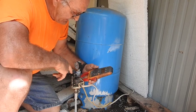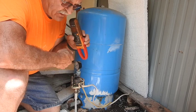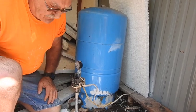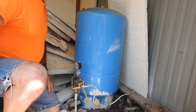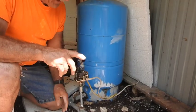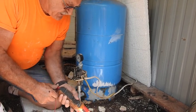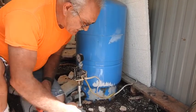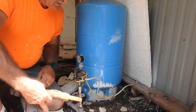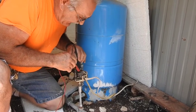In the meantime, I'm going to un-power those wires going down to the motor and do an ohm test, because the motor could have opened its windings. I'm going to find the disconnect to kill the power before I disconnect those wires. I was able to find the disconnect — it's on a pole about 30 yards to the south of me. There's a 100-amp breaker serving the home and a 30-amp breaker serving this well area. I've verified the incoming power is dead.